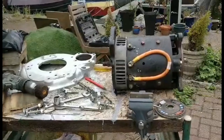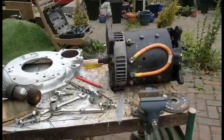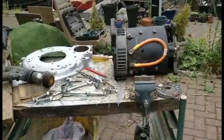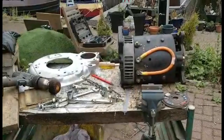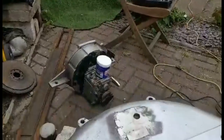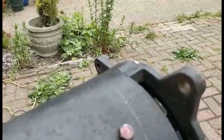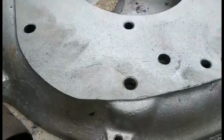Right, this rather boring bit here is just to show you some of the bits we've had to go through. As you've seen, we've more or less got the motor in place and everything. Then we've realised there's just odd bits we need to tweak and an odd extra bolt here or something like that. So the whole lot's had to come back out, and that's to basically do things like, say there, we've had to put another hole in the casing that lines up to one of those bolts there. Yeah, we've had to re-tap a couple of these outer bolt casings,